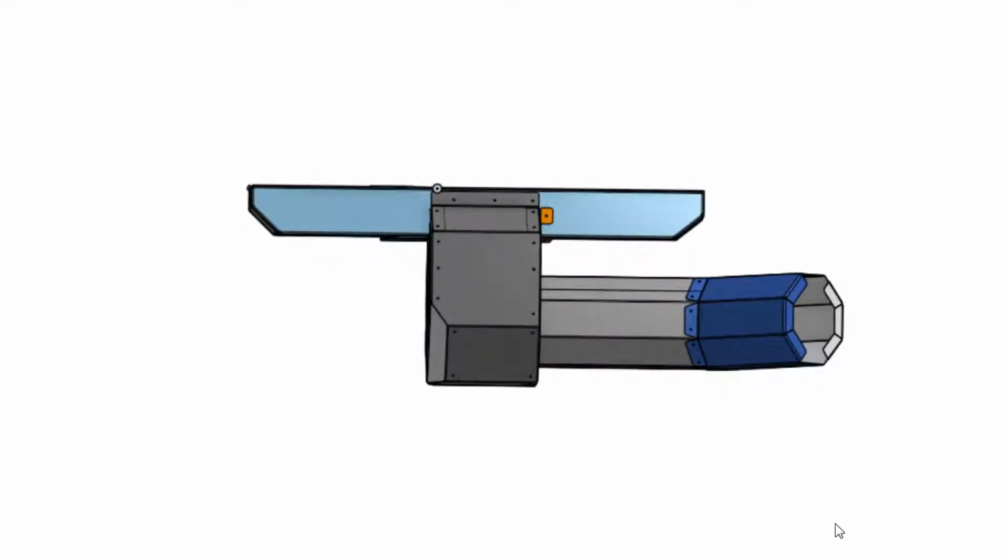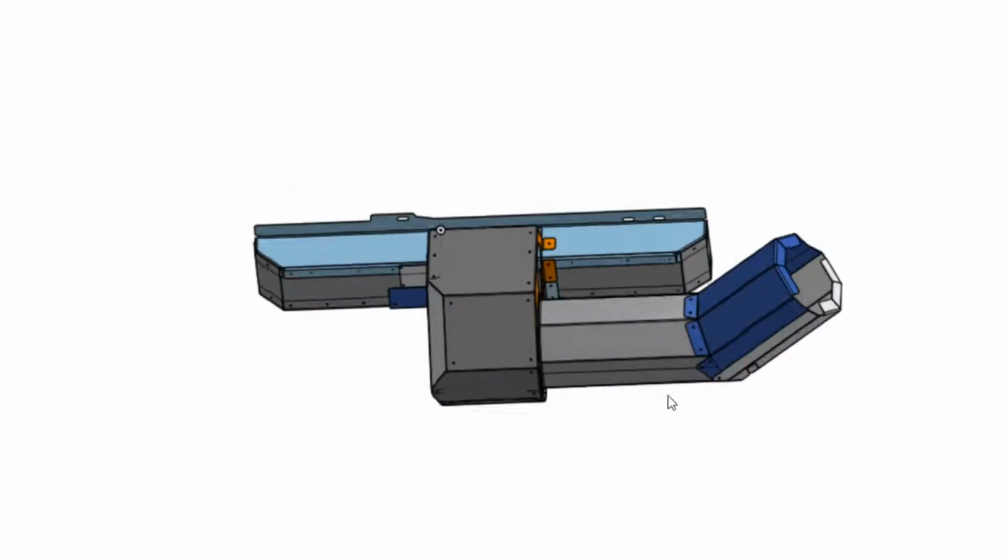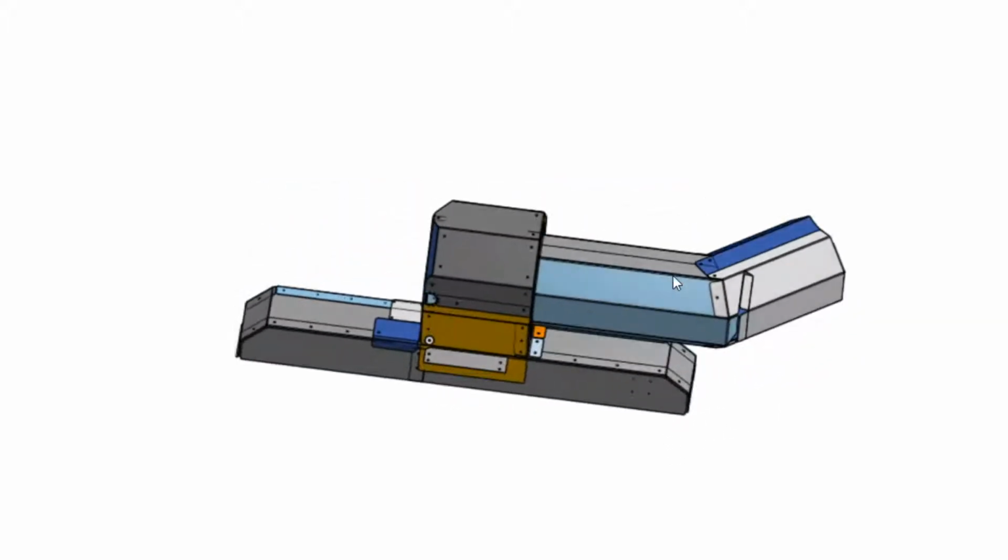This would be looking down on the top. Where my cursor is up here is where the engine would be, and we're bolted onto the side around the exhaust manifold. The manifold would be inside the part that's outlined there. The exhaust turbine will fit inside this larger box here that's highlighted. And then the exhaust pipe comes out here and it makes an upward bend before it dumps out at the muffler up on the right hand end here. So that's the general orientation of our enclosure.